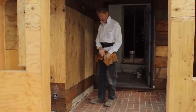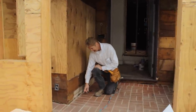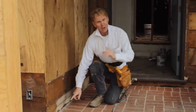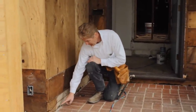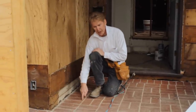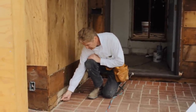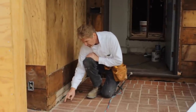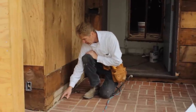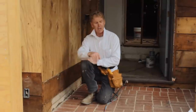Anyway, for example, Jay and I were looking at this, and we were going over it with the homeowner, and I said, man, we've got to figure out a way that the city says, hey, I like that, because we've got to put a weep screed here. And what's a weep screed? I'm going to show you that in a minute. We can't put the weep screed directly on here. If you're doing a deck, a roof, a front porch, a back porch, the city wants to see that weep screed off, because if you ever need to change this, you don't want to tear off all the stucco.